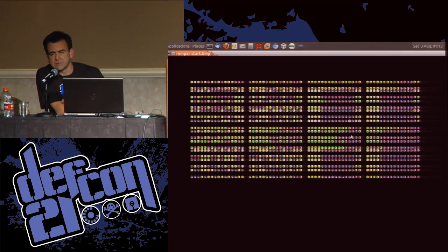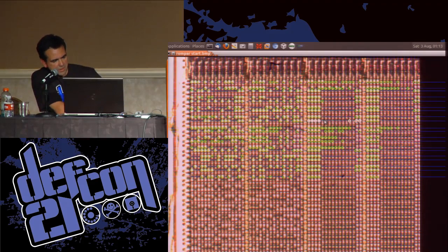We also want to try and make sense of the data. So in this particular case, we knew that an unused piece of ROM has a hex value of C1. So if I come out of peephole mode and we look back at the original image, there are these big chunks of unused data here. Okay, so here's obviously program, and here is nothing. And this repeating pattern, therefore, we would say that must be C1s. So what we should see here, because it's 16 bits, I'm hoping is C1, C1. Now, the quick amongst you will have noticed I ain't going to get that.